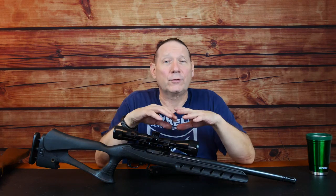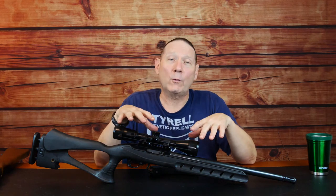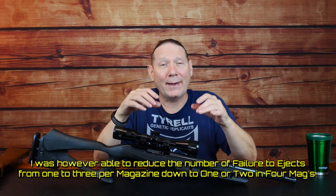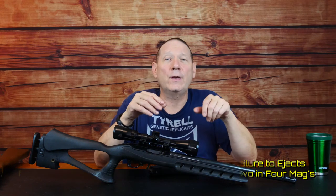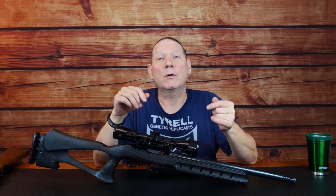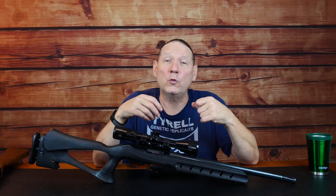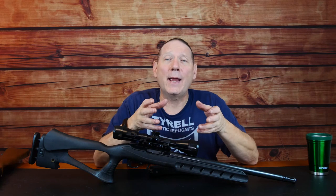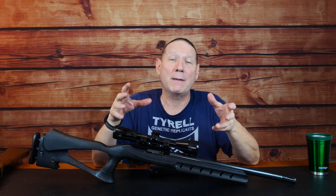Now, at the end of the day, was I able to successfully eliminate all failure to ejects or stovepipes? No, I was not. And there's a reason for that, and that is wear inside of the receiver. So at the tail end of this video, I'll be showing you the inside of my well-used receiver, comparing it to a much newer receiver with, say, less than 500 rounds through it. And I'll show you what to look for to be able to determine if receiver wear is part of the problem that you might be having.